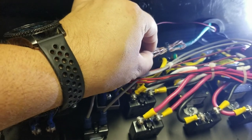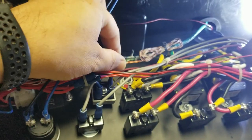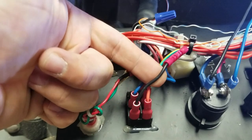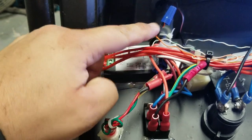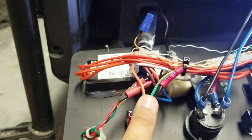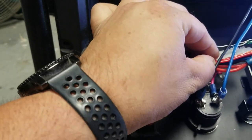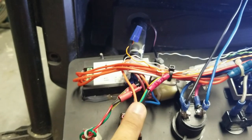I've wrapped up the brown wire and secured it so it's not touching anything. Orange is connected to the ground on the ignition circuit — here's the ground for the ignition circuit. I cut it, and I interrupted it with a normally closed relay, because for the generator to turn off, it needs to be a complete circuit. So what I'm doing is opening that circuit during the start sequence, and when the relay turns off, it returns to normally closed, keeping the ignition circuit turned off.